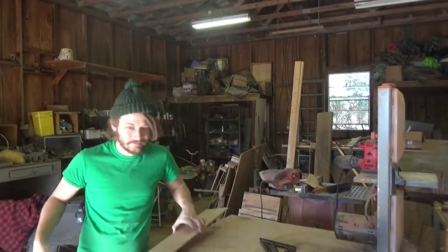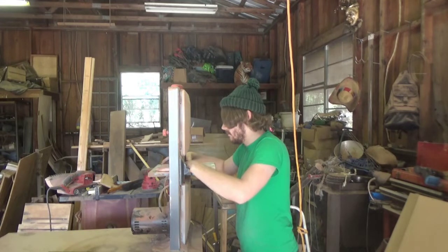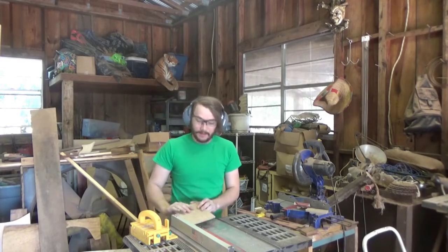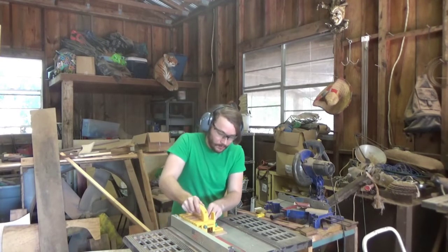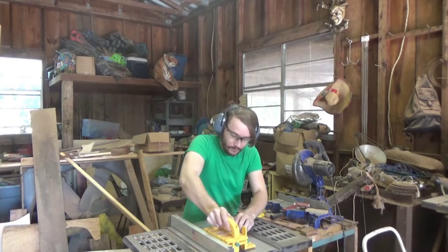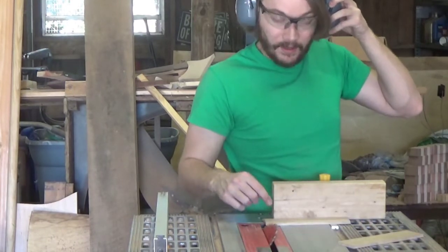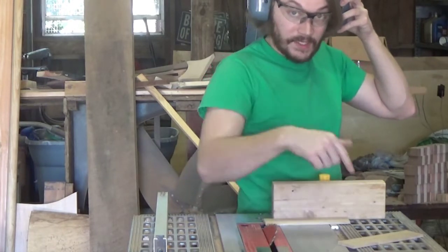Strike a line, my friend. I picked a strip that looks good for the box and I'm gonna cut those strips out. For my box I'm gonna be doing miters, and to start off I'm just gonna do the first miter cut on here, then I'll set up a stop block so I can make the sides the same length.